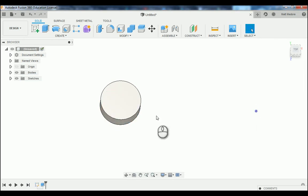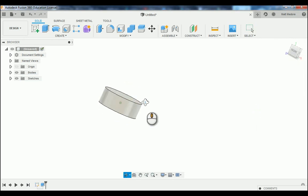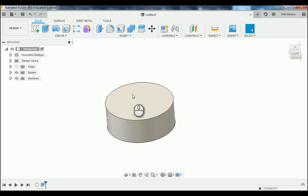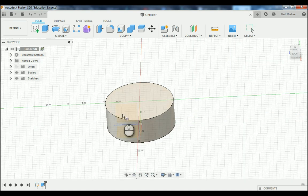Let's move on to sheet number two. We're going to lay out our bolt hole circle. The very first thing we're going to do is create another circle. In this circle, we're going to create the sketch on top of the part, so we're going to go C on the keyboard. Be mindful that you are not clicking on your triad planes — you're going to be clicking on the top of the part. We're going to anchor our sketch right off of the origin and drag it out to type in the diameter of our bolt hole circle.